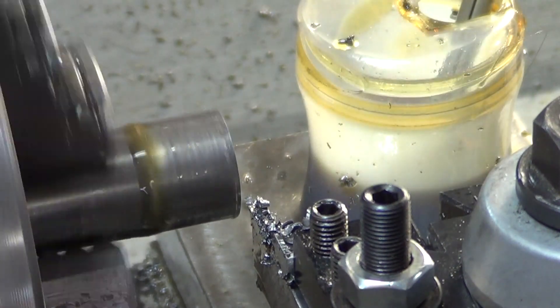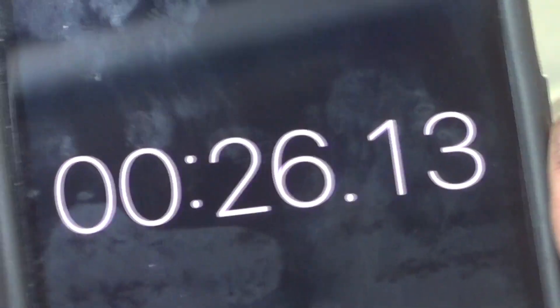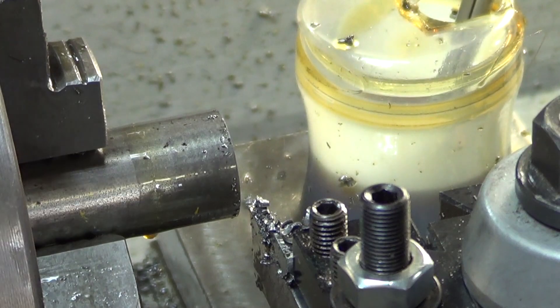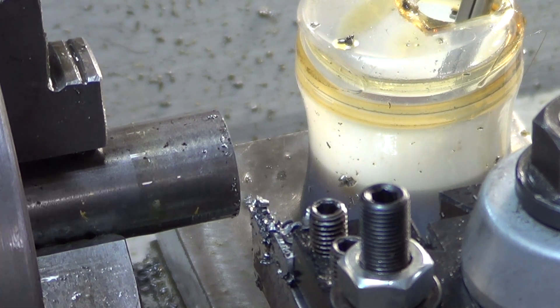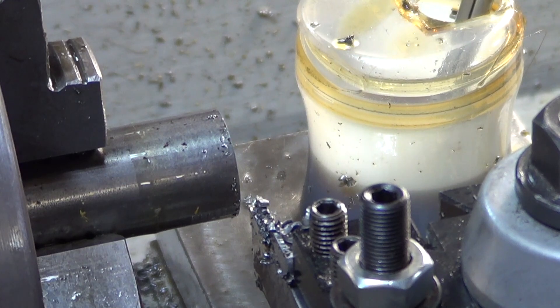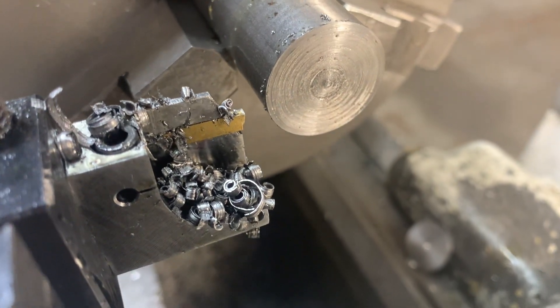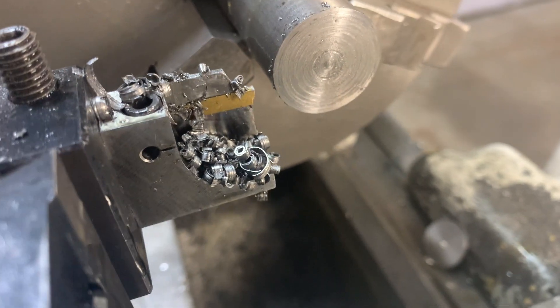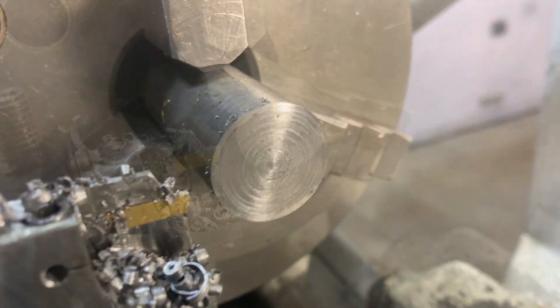That was 26 seconds to cut a one-inch piece of steel with my tool. Am I impressed? Well, I am. And there's still lots of room to go — I could actually cut a piece that's one and a quarter inches with this thing. Here are the chips coming off, pretty consistent regardless of speed or feed rate. With this feed rate the chips are a little bigger, but I'm pretty pleased. The surface finish is pretty good too.